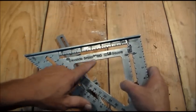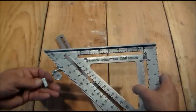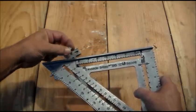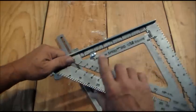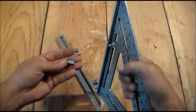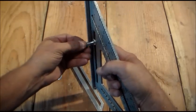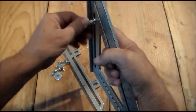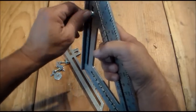With the Swanson Speed Big 12 Square facing up, I'm going to take this large bolt — it's the quarter by three-quarter — and stick it right above the S on the Swanson. Then add the small washer and the long hex nut right there. Tighten it down temporarily.